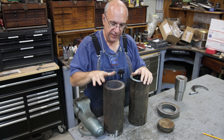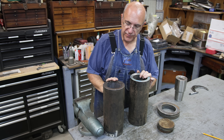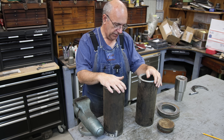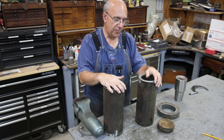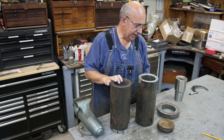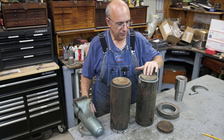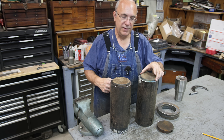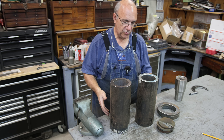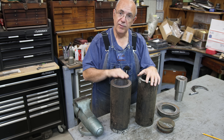This is the thick wall tubing — five and a half inches in diameter. I've got plenty of meat here after we turn that quarter inch off the outside. These are a little bit longer than what I need — some cutoffs I was able to get from a steel place that didn't cost me an arm and a leg. A heck of a lot cheaper than buying a piece of solid stock. I also got these little discs cut out on plasma. We'll just weld those in place, drill a hole — but these need to be cut first; they're too long right now. I'll cut them to length, then make the bar to go in between them, and get the end caps welded on.